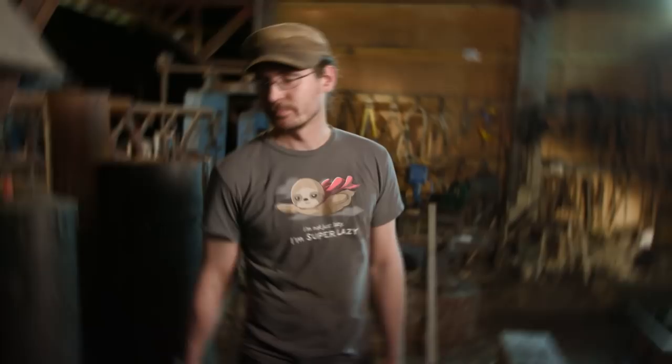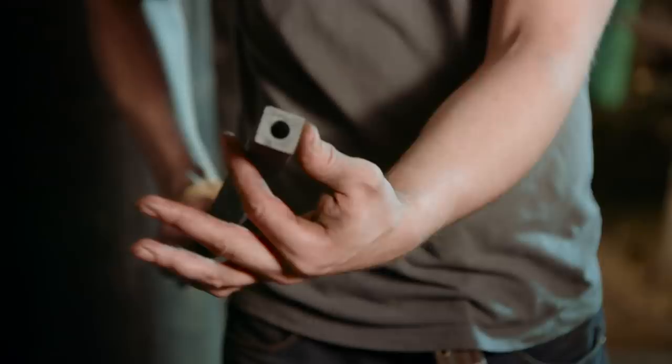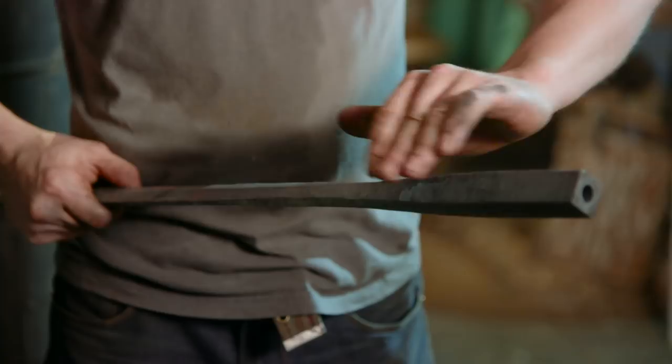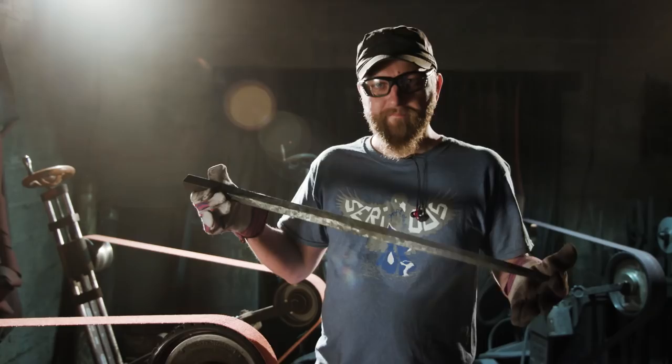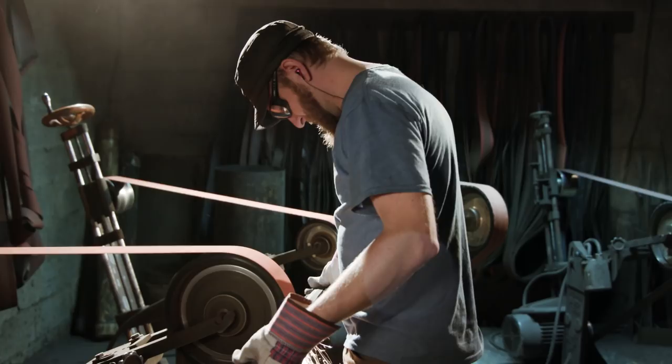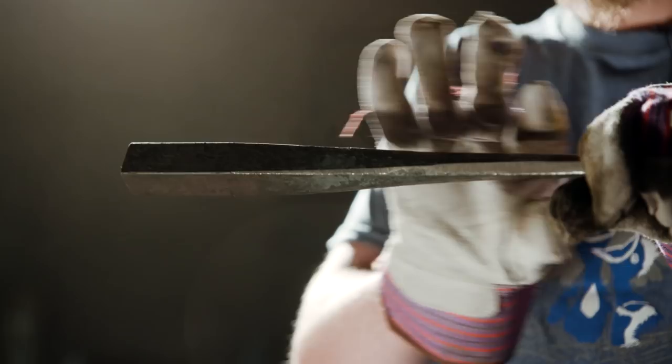While Kerry is figuring out the rest of the machining done on this build, I forged out the blade. I had to take great care not to squash the hole which will attach itself to the rest of the mechanism, so I left it at one inch square. This transition is a little bit awkward — when the angles are so steep, beveling a blade, you don't have enough force to move the material in on itself. This gives Matt more material to show his skill in making a nice transition between a square and a standard diamond. With the blade now forged, I've been able to start grinding — all I've done at this point is trued up the perimeter. My next major goal is to smooth out the transition from our square gun barrel shape into our blade shape.